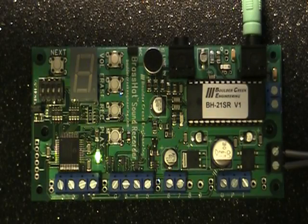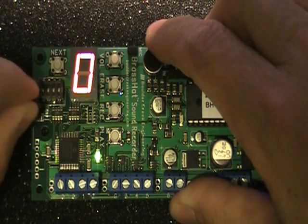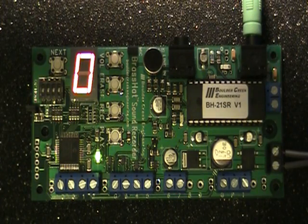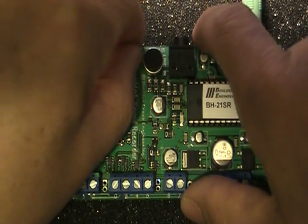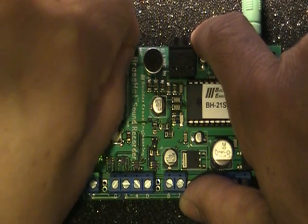The blinking green LED shows this sound recorder is in run mode with autoplay options turned off. Let's put it in edit mode by opening the edit jumper, leaving the jumper on 1 gold pin for safekeeping. The display shows we are at track 0. Opening the mic jumper turns on the microphone for recording. Press and hold the record push button to record.